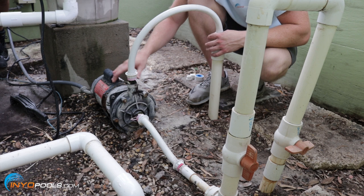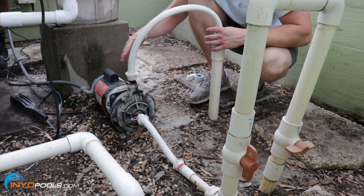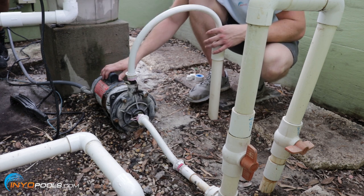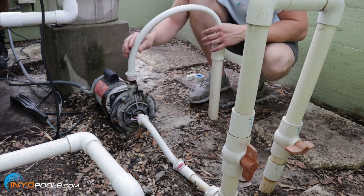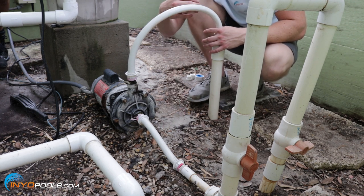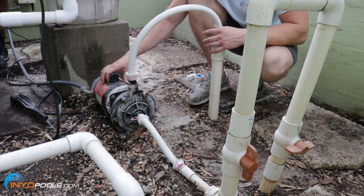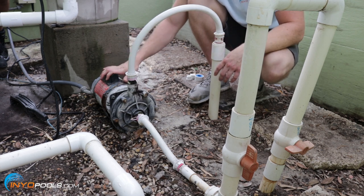The only other step you have to do is disconnect the power at the timer. Before you do that, you want to make sure all the power is off, so cut it off at the breaker. If for some reason you have rigid PVC plumbing, what you do is cut the plumbing, then glue a cap on, and then disconnect it at the timer. And that's about it — that's all you have to do to remove a booster pump.